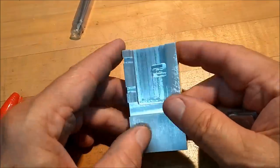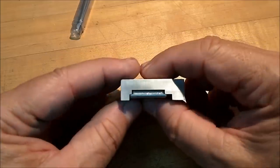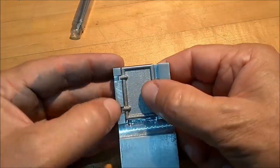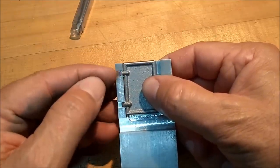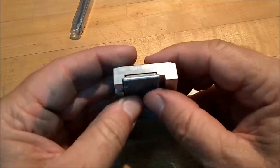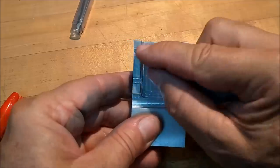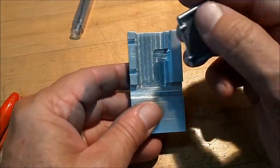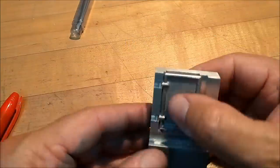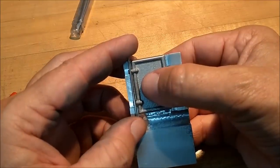After a little bit of fussing around with some scrap, this is the jig that I've knocked out for the hinge location on the door. It banks on the closing surface of the door, and it gives me a good clean shot at the bosses on the end. Now, after coming up with all the numbers from the outside to where the boss starts and the height and the depth and where everything registers, I'm going to set this up in the vise, squeezing it on a parallel, drill right down through the outside boss all the way down to the bottom using the center as the guide. You've seen me do that before. I'm going to use an .062 reamer, about a millimeter and a half diameter. And if all goes well, when I'm done, the hinge pin should fit nicely right down the backbone, like so.